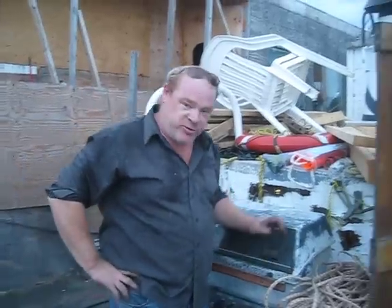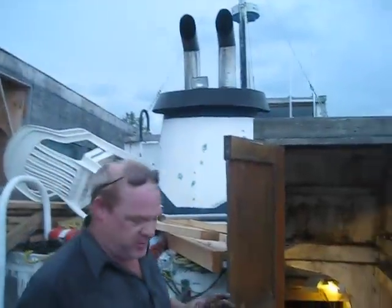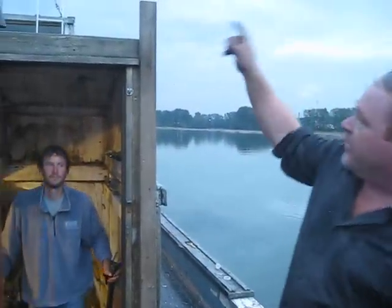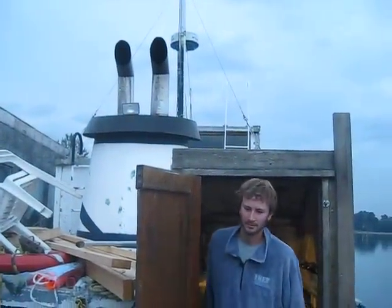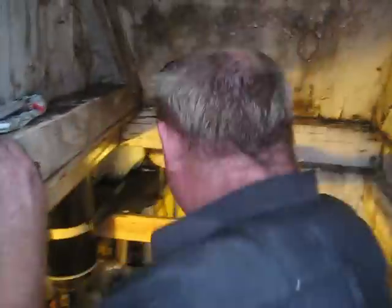So your standard day tug has a lot of wasted space. When you convert a tugboat to a liveaboard, the first thing you've got to do is get rid of that bloody stack. Not to mention, you can't have dry exhaust over your hot tub. It's just simply not cool. So what we've done is convert the boat from a dry stack to a wet exhaust.